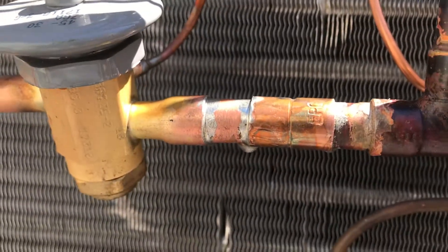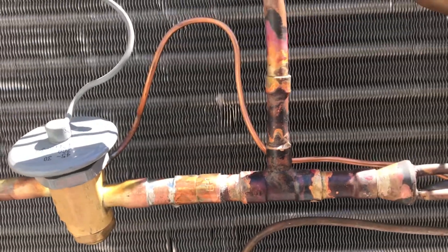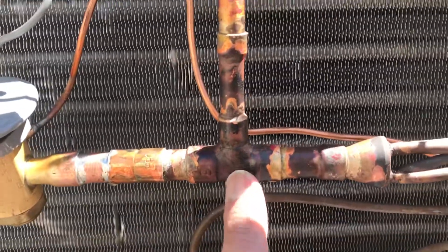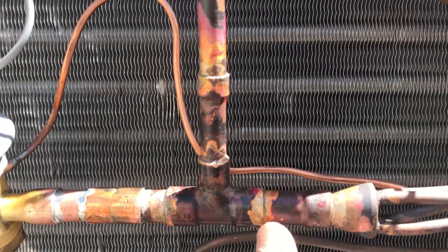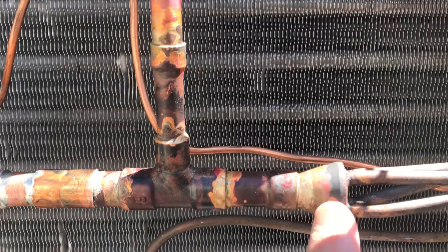You can see just how clean it is. We purged nitrogen through everything because there were other parts where we brazed. On this T-fitting here we brazed that little pipe on there, which is actually a reducer, and then we brazed this reducer onto the distributor.